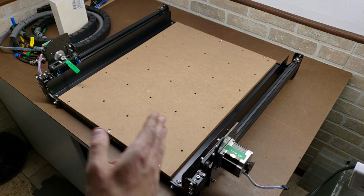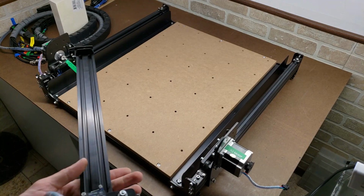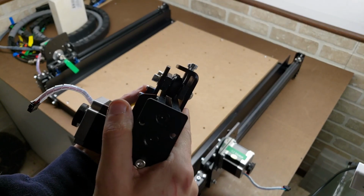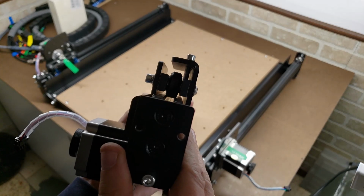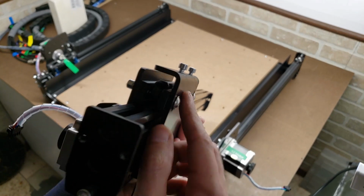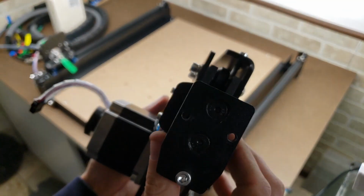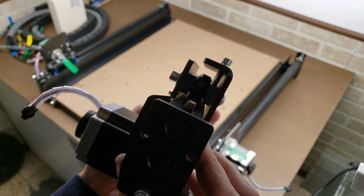And one of the y-axes, that one over there, the roller wheels were a little too tight. And on the gantry here, they are, I think, too tight. Very tight, actually. So if you look, these are the screws that tension the wheels down. But if you look, you can actually see a gap here. These bolts here actually I don't think are tying down. You can see that the lock washers aren't even collapsed. And you can see a gap down the line here. These blocks, they should be bolted down. So it's not a big deal.